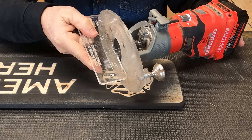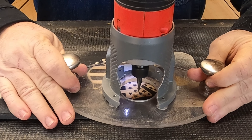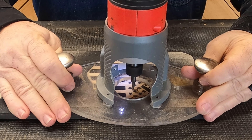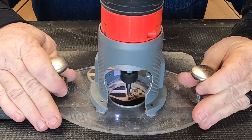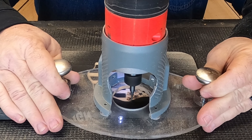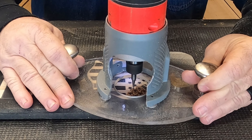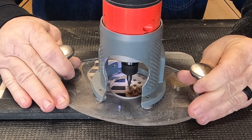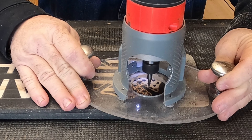The first bit we used was the carving liner bit at an eighth of an inch deep. When it comes to fine detail, this is by far the best bit we've ever used. There are some other ones out there like the SC-50, but this one really cuts so smooth. For such a fine detail bit, it really cuts well — some of the others tear out a little bit and are harder to control. This is a single flute bit that comes to such a fine point that you can really get into small areas you wouldn't be able to reach with a profile bit.